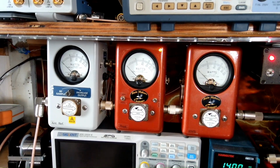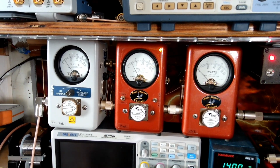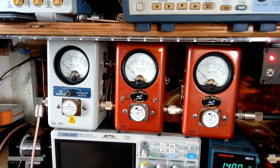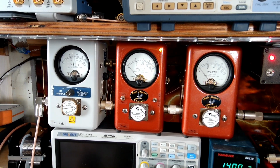All right, so all the way down, I currently have the RF power set at 1 watt all the way down, and we are in the AM mode. And then FM, let's go over to FM here real quick. Well, you can see what it is on the low carrier for FM. Okay, FM is going to be approximately 1.5 watts.